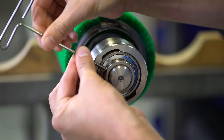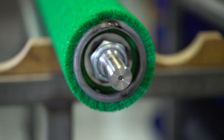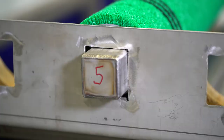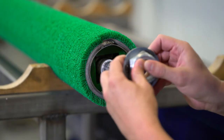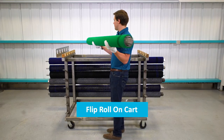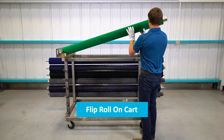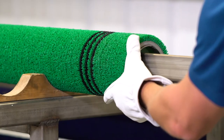Next, we are going to show you how to take apart a roll. Once the rolls are removed, remove the bearing by loosening the set screws and lifting it off the shaft. Fix the square end of the shaft to prevent the roll from rotating. Using the provided socket wrench, loosen and remove the hold down nut located behind the bearing. Remove the shaft from the roll, pulling from the driven square end and set it aside.